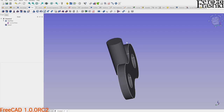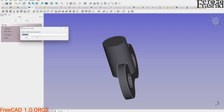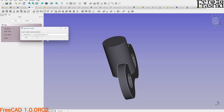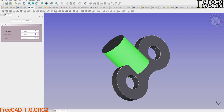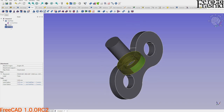Now I want to build the mid spacer — a tube that sits over the dowel pin. The inner radius will be two millimeters, linked the same way: sketch side plate dot constraints dot dowel dia divided by two. The outer radius will be a little more, so I'll copy that formula and add plus 1.5 millimeters, giving about 3.5 millimeters. The height I'll set to two millimeters for now. This is the mid spacer — all three parts are done.